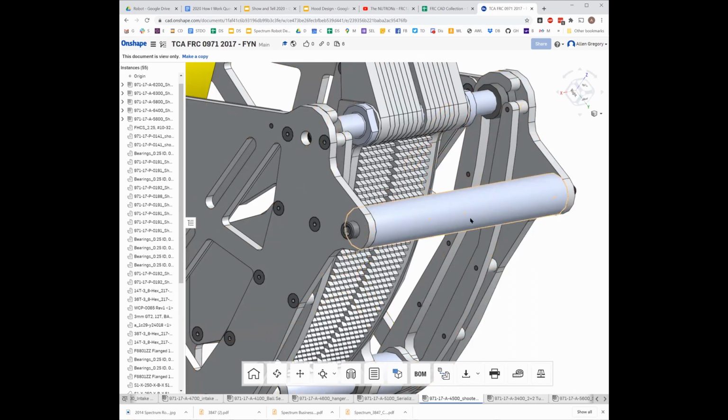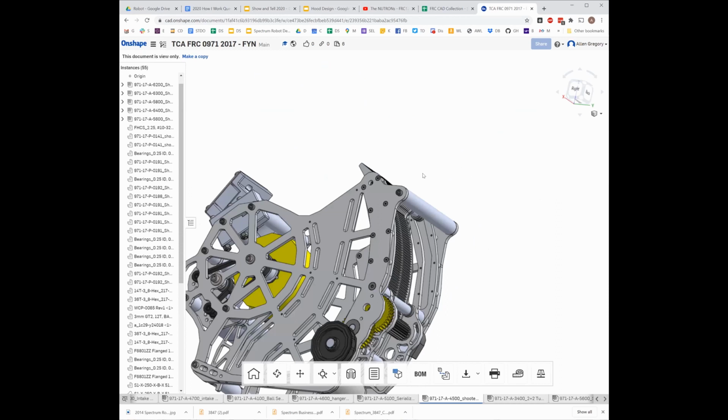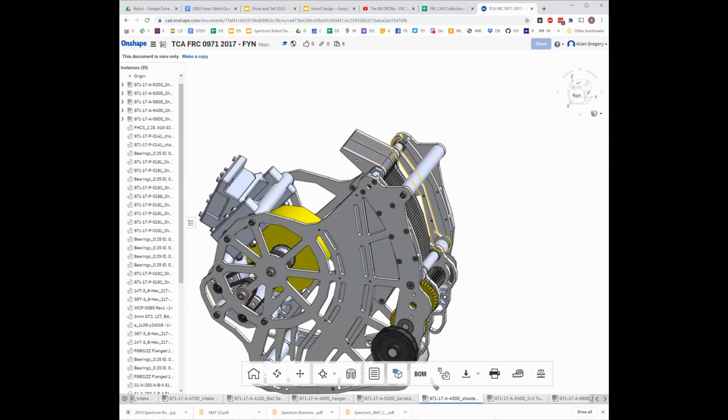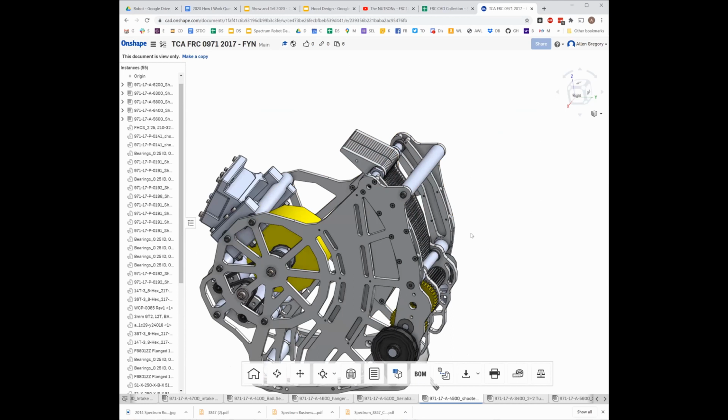Yeah, and then it can go all the way down. So these two bearings are able to go all the way down. This is actually, for the 2017, because of how the shooter was done, the farthest forward it could go. The rack actually drives it back down really far, if it needed to. I doubt it shot that deep. I'm pretty sure it shot somewhere in the middle here. But the arcs had to be so high in 2017 because they were shooting into the boiler, which was this horizontal goal. So the balls had to be falling in from a really high release angle.